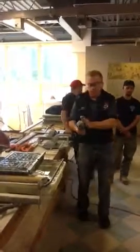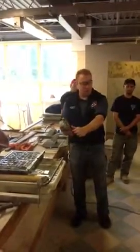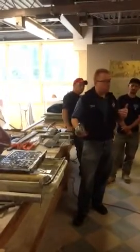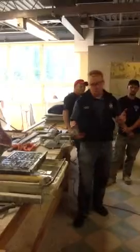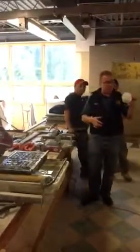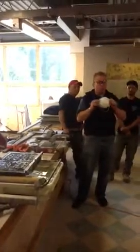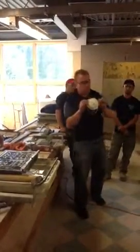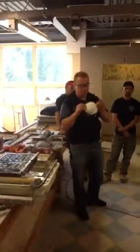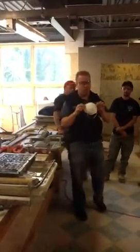Now with this, you're not going to have water. Okay? So you're more prone to get what? Dust. Exposure to silica. Harmful silica. So with that, would we use a nuisance mask? No. Because in OSHA we realize that this protects us what from silica? None. So this is no good. If this is what your company is applying with, get rid of it. It's ineffective.